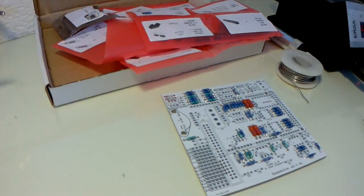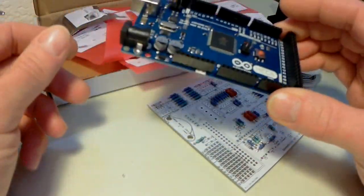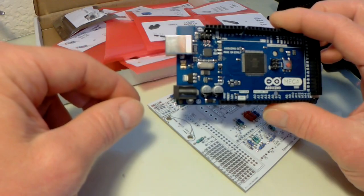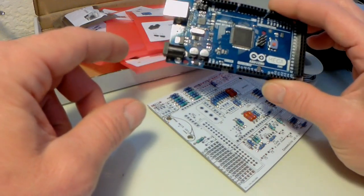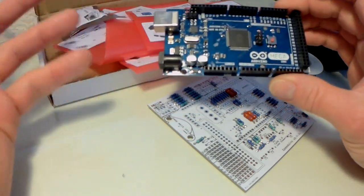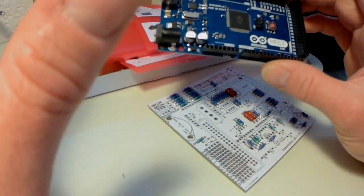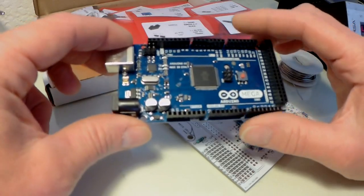So it was only 70 odd pounds because I already had the Arduino, the brains of the ECU. This will need programming with some firmware so that it can run in Tuner Studio, and also we will then have to load a base tune or write a tune from scratch. Rather not. It's tedious, long, boring. It's better to load a base tune up and tweak it. It's much easier, much simpler, because it's easy to get the car started then. So I'll probably do that.